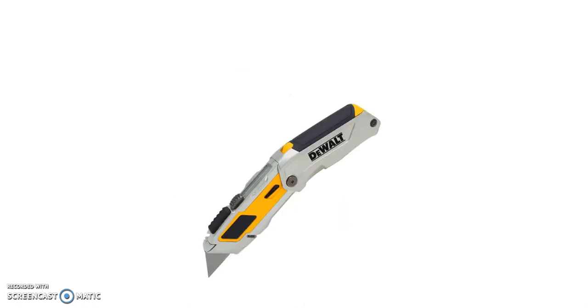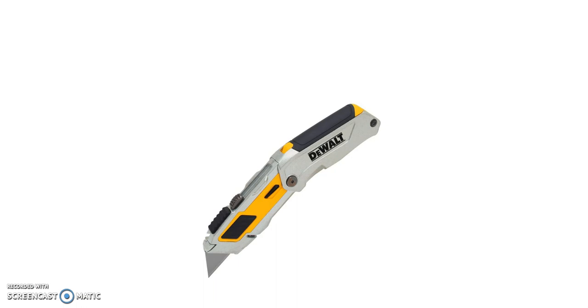The next tool is a knife. This is going to be used to make all your cuts on your drywall. When you make your cut, you're going to have to cut the other side of the drywall as well, because when you make the break, there's paper on the other side that needs to be cut too — you're just not going to be able to get that with your first cut. So when you make the break, you need to flip it over and cut the paper as well.